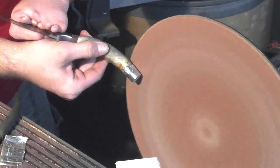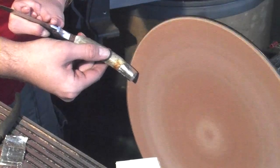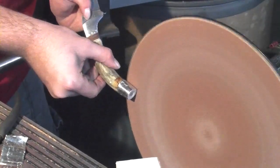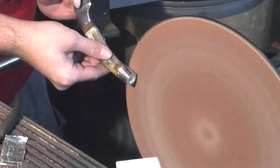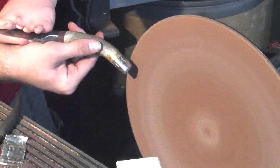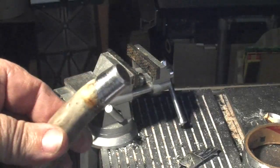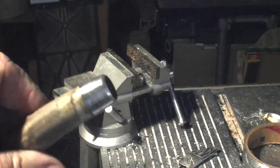Now comes the finishing. We put it on a nice heavy 80-grit wheel — it'll take down all the high spots until we get all the low spots even with the high spots. You get all the pitting out of it and make it look nice and even. Now this is the perfect thing.